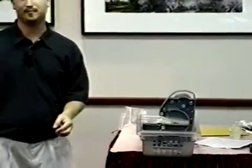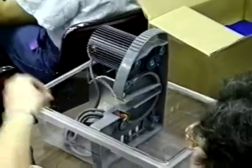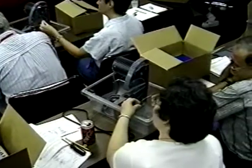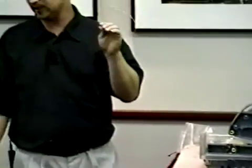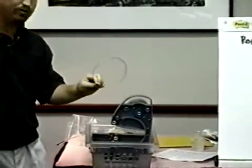Now we're back to aligning the saw. Everybody's got theirs off — show me your blades. Now, align the nose of the saw. We took this blade out because we don't want to damage it. It's a brand new blade, it's an expensive blade, and it could give you a lot of hours. So we want to keep it in good shape. Set it aside, set it down flat — do not hang it, don't put it under the saw. Make sure you remember where you put it along with those little screws and grommets, because nothing is worse than not having everything.